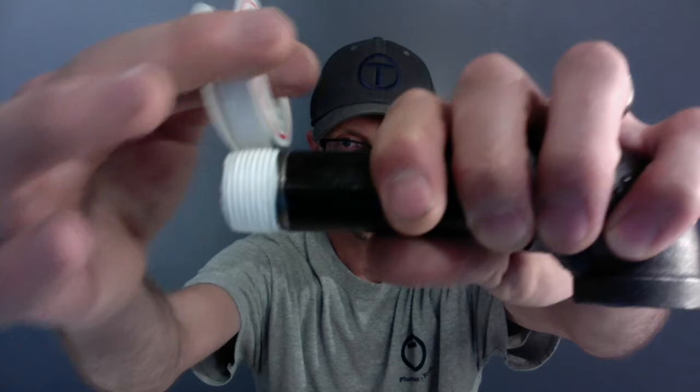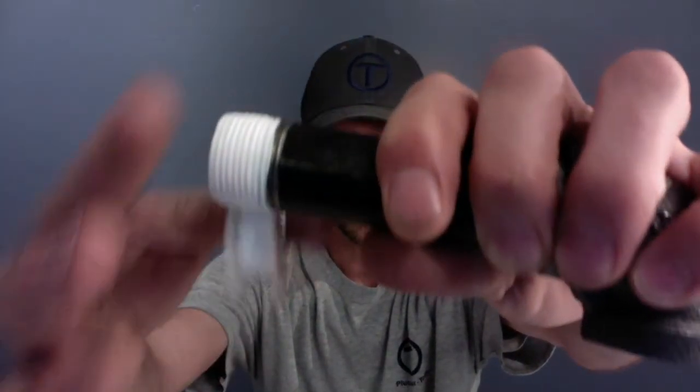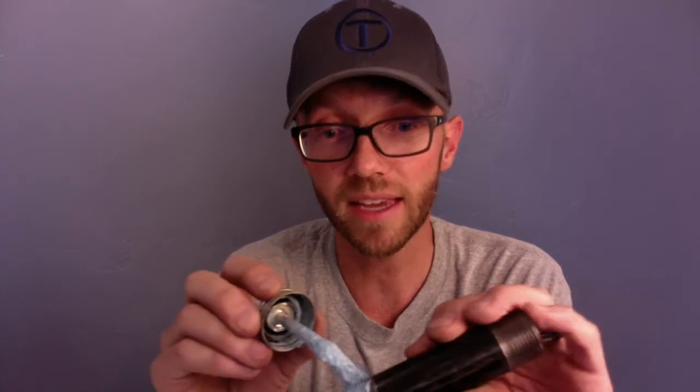Notice here I'm using my thumb and my middle finger intermittently to put pressure against the roll of tape, and this way I can move it around. Back to the question of do you do pipe dope or Teflon tape first? For me, I like to put the pipe dope on first — it's cleaner to deal with. I like to work clean. So we just take it and apply it all the way around the threads. You are not supposed to put this stuff inside the fitting, because if you put it inside the fitting threads, that thread sealant is going to get pushed into the pipe — it builds up and makes a mess inside. It's not really going to hurt anything, but it's excessive and it's actually against code. So we put some of that on, and then I'm going to take this white Teflon tape and wrap it about seven times.